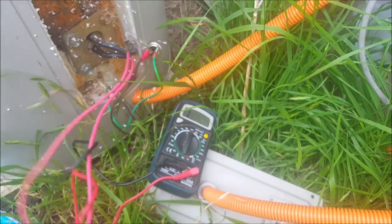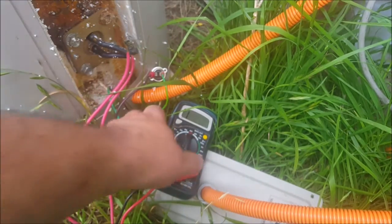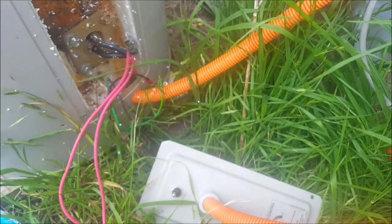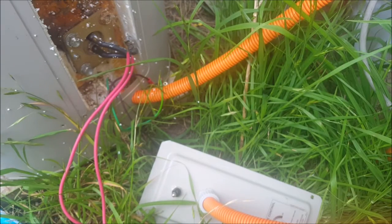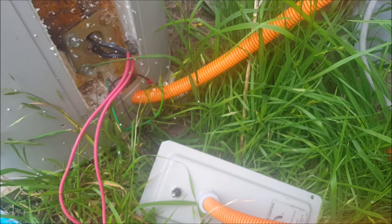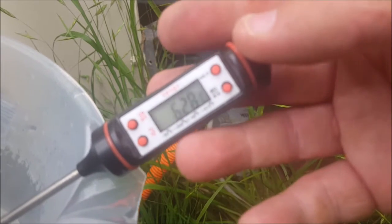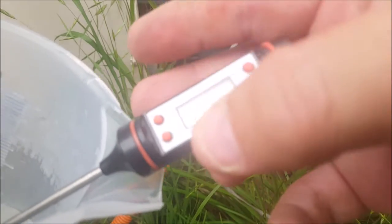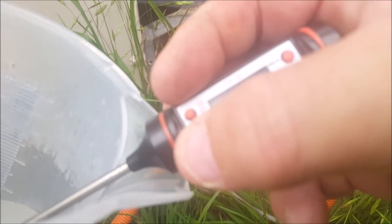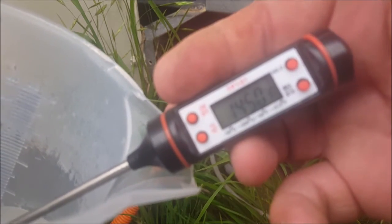Although I'm not going to see that today just because of the overcast weather. For this to be a 600W element, the resistance should be 3.84 ohms, or thereabouts. The temperature there is about 62.8 — about 63 degrees Celsius, about 145 degrees Fahrenheit.